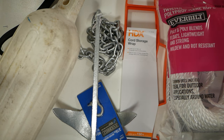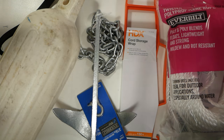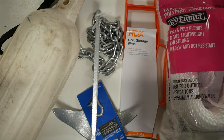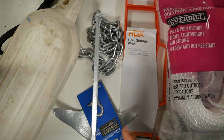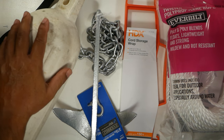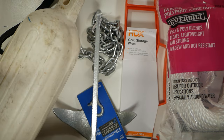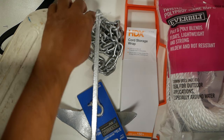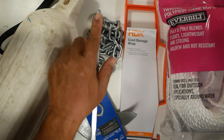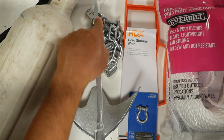Time to build our replacement anchor setup. I used what's called a Q-RAS, which is Quick Release Anchor System. I'll put a link to a video somewhere around here which shows how I build them and how I actually use them. Very important when anchoring in the current — like the bridges down here and the channels out on the reef — because you need to be able to break that anchor free so it doesn't get stuck. I went ahead and stopped off at Home Depot and West Marine and picked up everything I needed. I've got the existing float — I didn't lose that — picked up this 2.2 pound claw anchor. This is important because it has the breakaway release system on it. I also picked up 3 feet of chain, and what that's going to do is weight the back end of the anchor so it forces it down and the tines dig in faster.